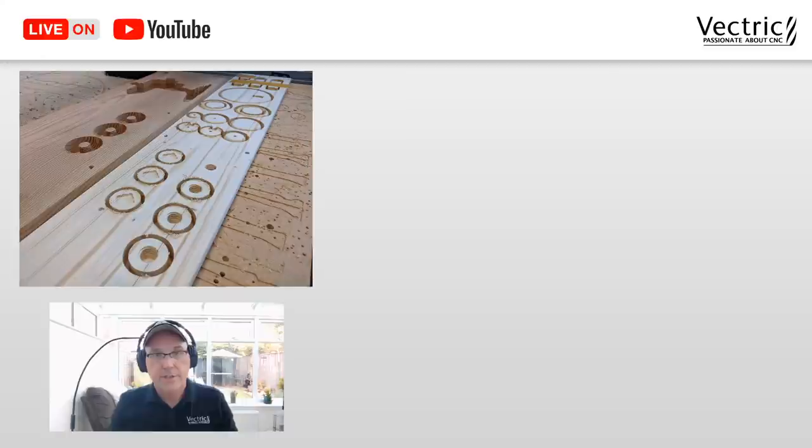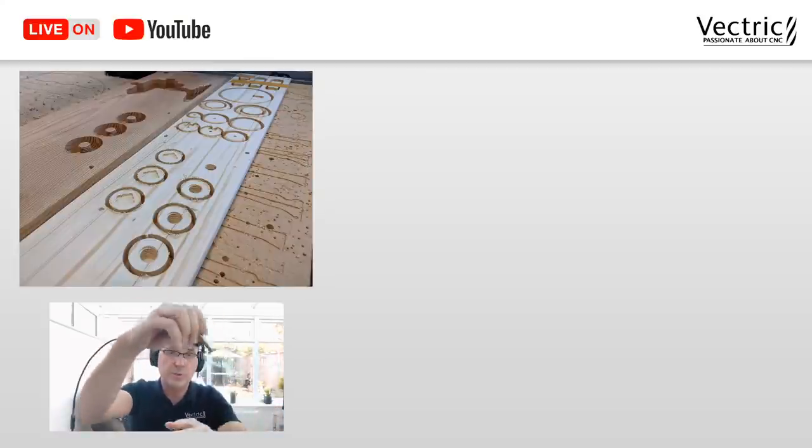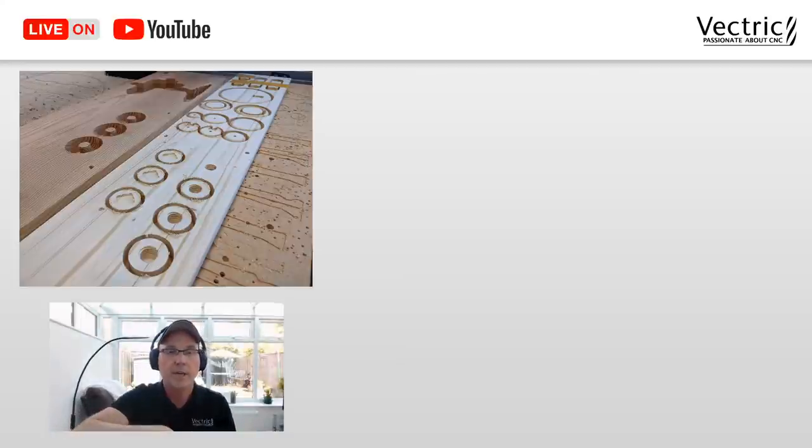And the way it works is in the software, you create the hole that you want to create, then you create an offset, and that offset is the pocket. Well, I started out with a 3/4 inch hole, and I offset it in, and then I used that offset. And I'm sure if you follow the logic there, the hole that this plunged into was smaller than it should have been. Luckily, this has got some cutting edges on the bottom, so it just did its thing and made its threads and popped back out again like a champion. But it wasn't the right size and didn't look right and was very unsafe.